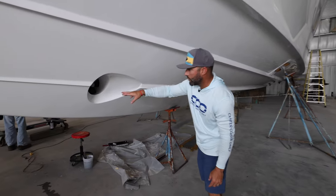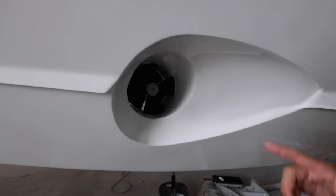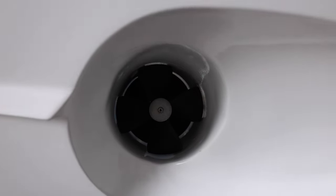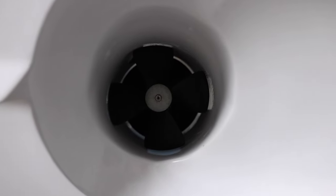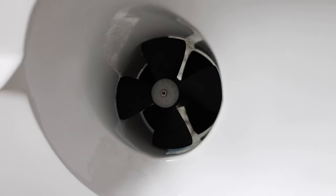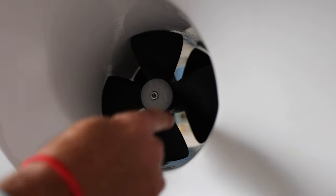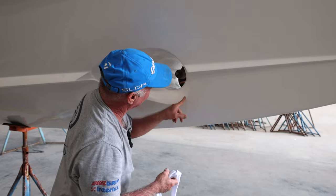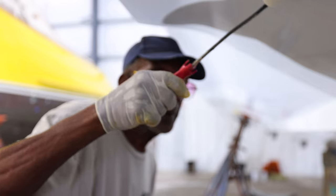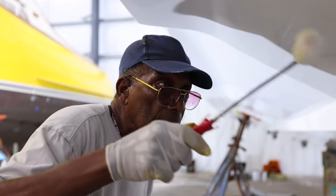Take a look at the bow thruster right here. You want to apply this stuff everywhere that you possibly can. They actually had the blades out of there once before while they were applying the Hallmax, so they did that first and then installed everything else in between. Obviously when you move around those props it'll knock off any buildup, but you definitely want to get every little bit and nook and cranny in there, because you do not have the friction of the water when moving the boat knocking off the buildup. Be very detailed when you get up in crevices like that.